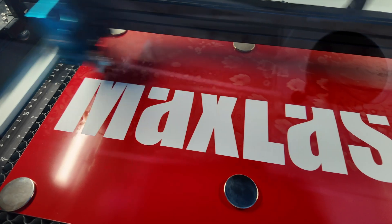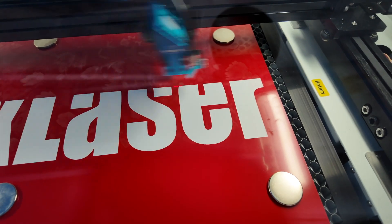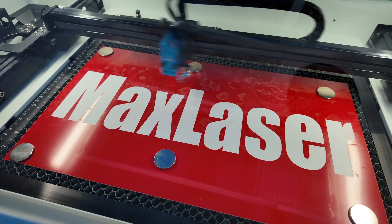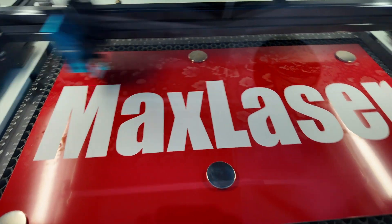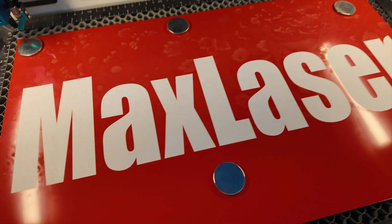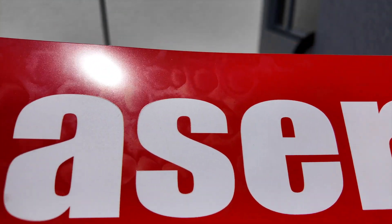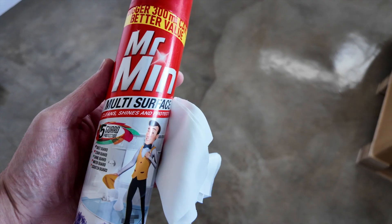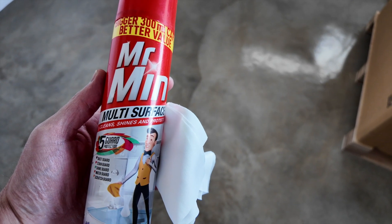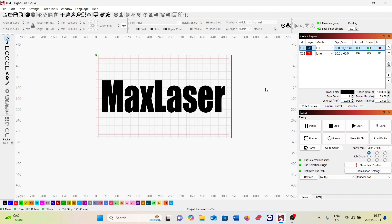Going out of focus, melting the material, and creating as little dust as possible really does help. You can see there's not much dust hanging around and the results are nice and clean and smooth with no lines. One thing I did pick up was some smudge marks, which I didn't anticipate. I cleaned it with Mr. Min and that definitely helped get rid of the smudge marks.